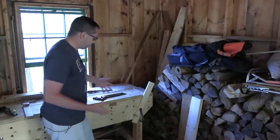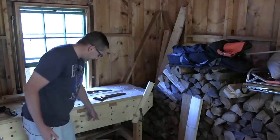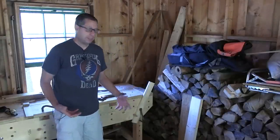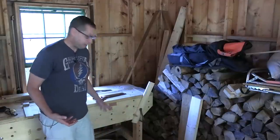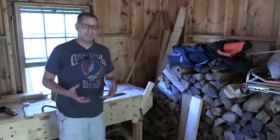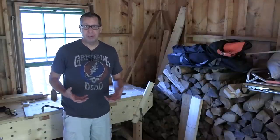And the beauty of this vise-less setup is, I have this peg here. I could move this peg out here or down here or down here and really take really, really wide boards. I could even have multiple peg attachments, multiple holdfast attachments across this wide apron. And the vise-less setup there is one that you just can't anticipate with a leg vise.